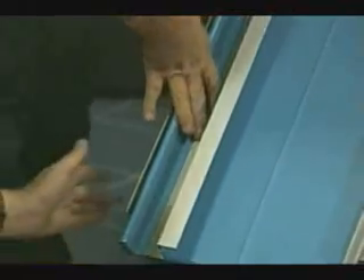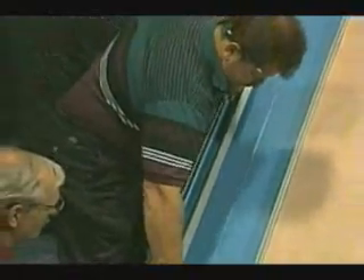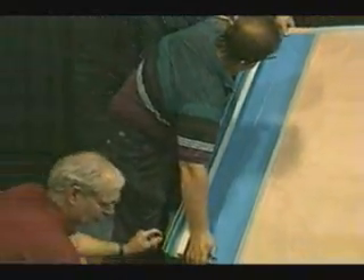The first panel is installed by placing the standing seam part of the panel directly over the clips and then applying constant pressure to the seam until a snapping sound is heard. This ensures that the proper locking has occurred.